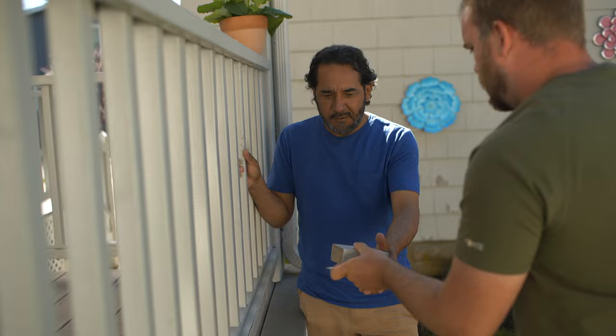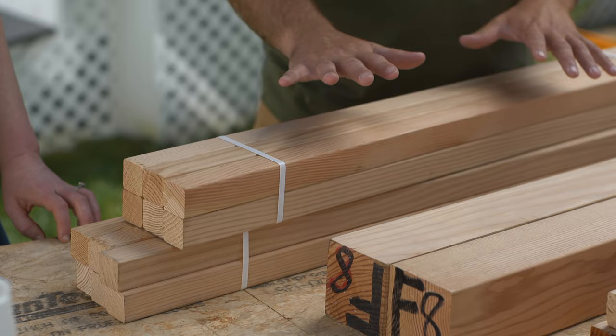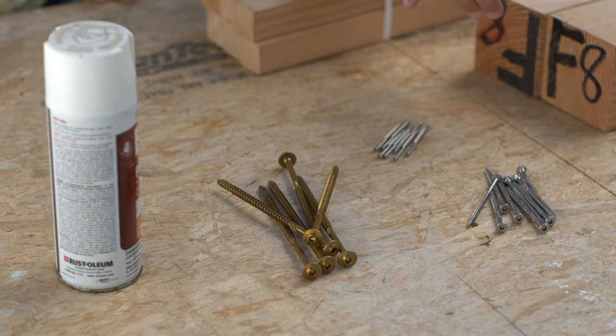So these are the parts and pieces that I picked up for your new railings: square balusters to match existing, four by fours for the posts, and two by fours for the upper and bottom rail. All straight grain fir — it'll take paint really well and it's very rot resistant. To fasten everything together, some stainless steel screws, and for the posts, some structural screws.